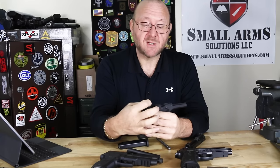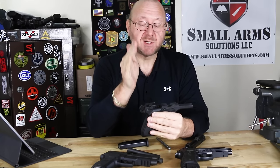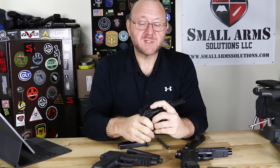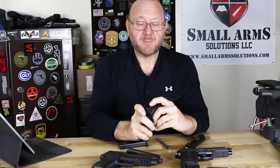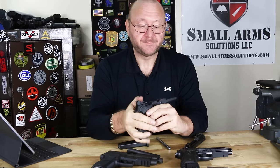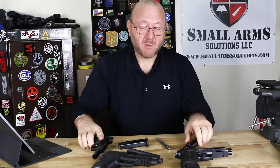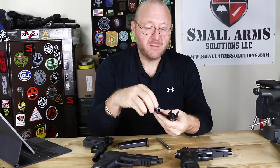You also see you have a nice little angle here that's cut in the ejector. What that does is it gives you a good consistent ejection pattern. This one here, when you rotate the safety, this is what decocks the hammer. It pushes down, and that releases the hammer. So a very, very simple, very robust system that gave the soldier the ability to carry a weapon safely loaded